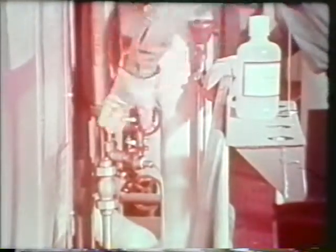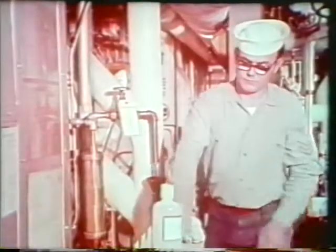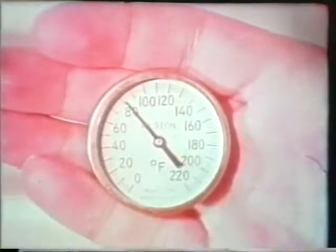Fully open the cooler's sample line exit valve. Let the sample flow until it flashes to steam. When the sample flow has flashed to steam, throttle the sample line exit valve until a liquid flow is obtained. Let the water flow until its temperature is less than 100 degrees Fahrenheit.